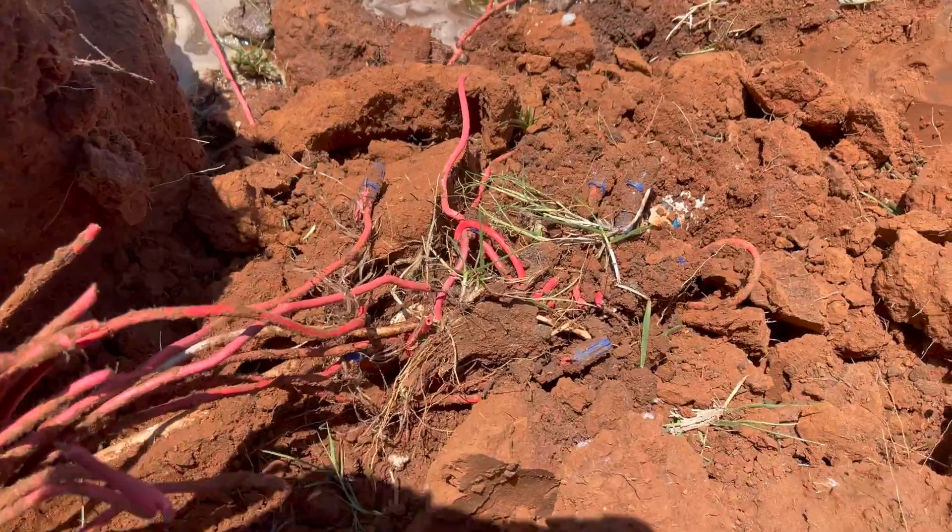Then I would have been more careful instead of just ditching through. So there are actually three things. I'm going to move what was number two to number three, because I just thought of this: the wire is all on top of the pipe. So that's another thing — when you're running your wire, run it first and have it all the way on the bottom, then put all your pipe on top. That way you're not digging these wires up the first thing you put a shovel or ditcher in the ground. So: one, put them in a splice box; two, put your wires down on the bottom of the ditch.